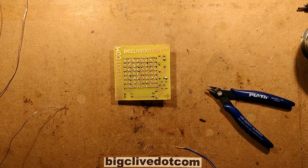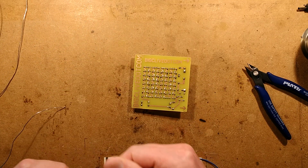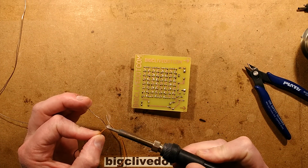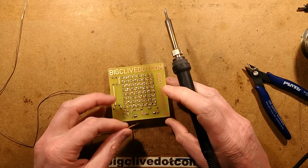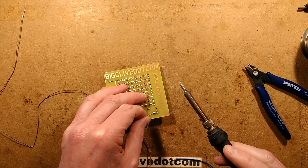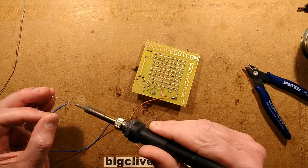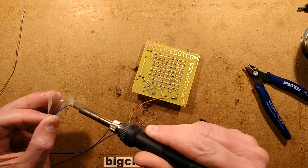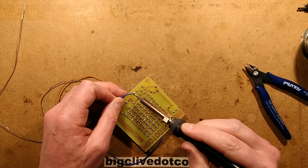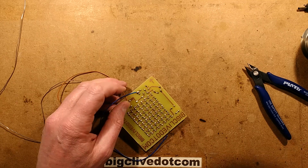So let's solder some leads on, and before I put it in the unit itself, let's test this and see if it goes bang or not. With mains circuitry and modifications, there is always that slight possibility that something's going to go horribly wrong. So here is my live connection, which at least goes through a capacitor to limit the bang, assuming it's a good capacitor. If it's a bad capacitor, it will contribute to the bang and blow every single LED up. Don't want that. We shall see what happens. I don't think the capacitor will be bad. There is other circuitry to kind of absorb the oomph there if it did do something terrible.